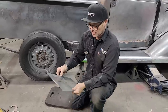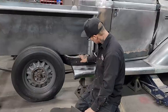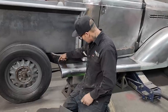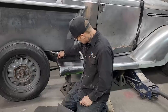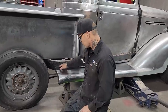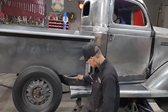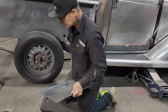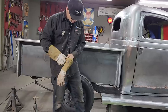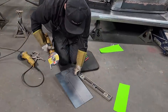I need a three-quarter inch flange going this way to meet up with the box — we can bolt it along here, maybe three bolts. I'm not going to bolt it to the running board, I don't think. I could put a hole through there and bolt it right to the running board on top, but it does not look like the ones I've seen were bolted on top. The running board is going to be bolted on its own to the side of the chassis — the fender just needs to be down there to close that gap off. So I'm going to cut this with a zip cut, kind of half figuring it out as we go.